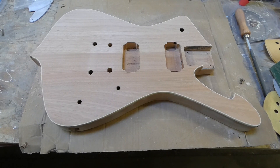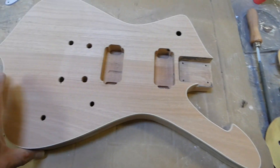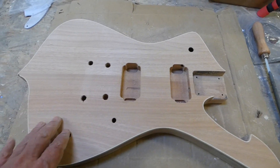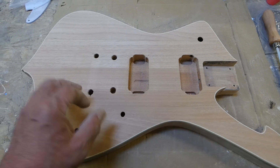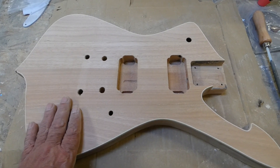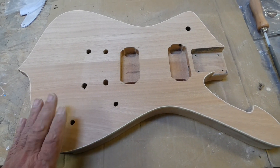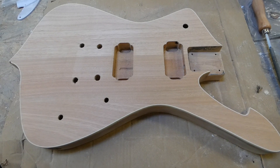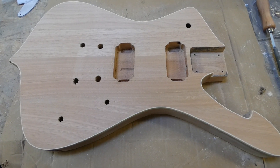Right on. So this thing's been sanded up to 240 now, all the way around. I just have to hit the sides with it to make sure everything is all the same all the way around. It's already looking way better. On the back side I had a couple of little fish eyes that showed up in the clear coat. I'm not a professional painter by any means, but I think it may have had something to do with some irregularities and some dust and some crap on the back that I should have maybe been a little more careful with. But that's what this is going to be all about — try to get it all done right this time. Like the third time.